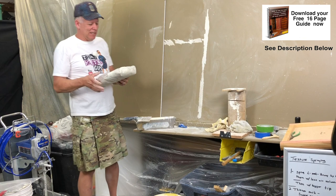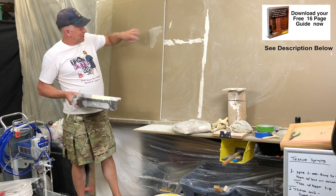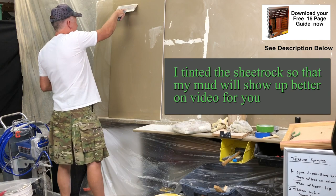There are a couple of different ways you could do this. You could mix up some texture, put it in a tote, and dip the pad into it, then stomp it onto the wall. This is actually going to end up being a knocked-down texture — you can leave it un-knocked-down, we've done that before too — but you're going to stomp it onto the surface and then knock it down. Or, what we're going for here is just spreading some mud on the wall.